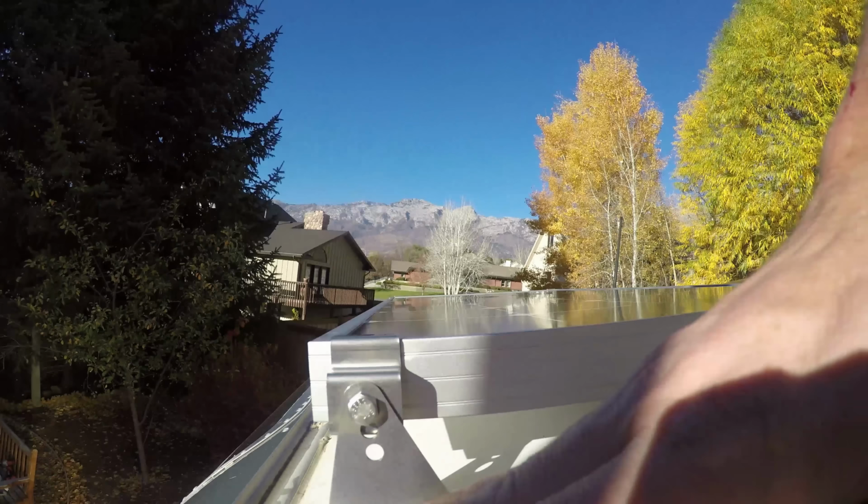My first step is deciding where I'm going to place each panel. I've got 6 of these to place. These are the boxes they came in, so if the box fits, the panel's going to fit. One thing I need to consider is the shading. Now when a panel is partially shaded, it's not working at its full potential. So I want to avoid places that might cast a shadow like the AC units.